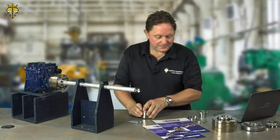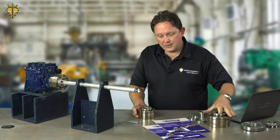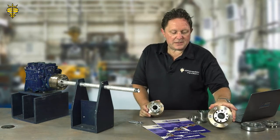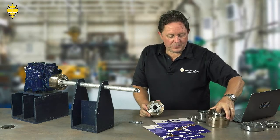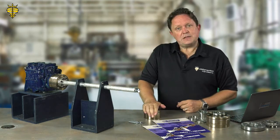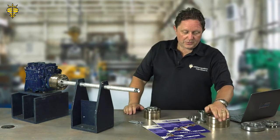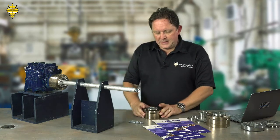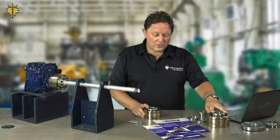You can see we have different sizes. The majority of sailboats are going to be using a four-inch flange — this is the SD55 — and this is a five-inch flange — the SD100, which is the next size up. The ratings: 55 stands for 55 newton metres of torque, and 100 stands for 100 newton metres of torque, relating to the performance of the system. The SD55 handles seven-eighths up to inch and a half shaft diameter, and the SD100 handles inch and a quarter up to two inches.